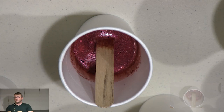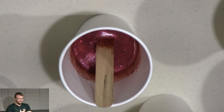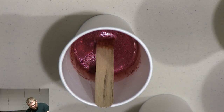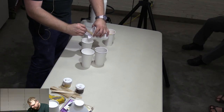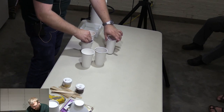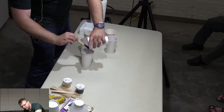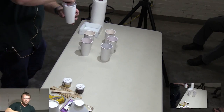Key notes once I start this: you're going to see how much time you really have, and you're going to see me scramble and maybe spill something. The goal is to introduce them to each other as soon as possible — you don't want to spend two or three minutes on one color and then mix to the next. Just pour them all through as soon as you can, and then you can always come back and stir them later. Although B is the hardener, it's always better to have a little bit more B than A, so I always pour my A into B, because there's some residue always in A.